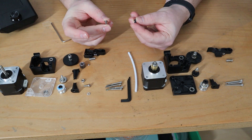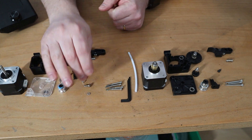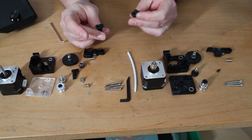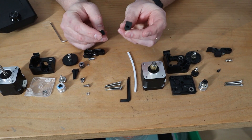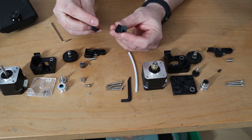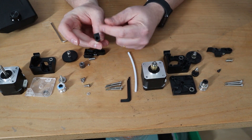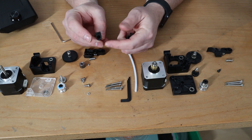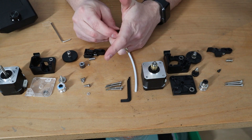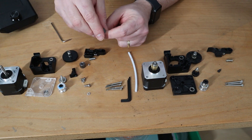The small screw for mounting to the stepper motor also differs between the two kits. For the filament guide, the clone has a standard single guide, whereas E3D includes two different guides — one for 1.75mm filament and one for 2.85mm. Now you know why there are two in the E3D package.